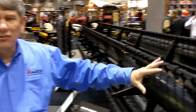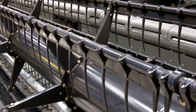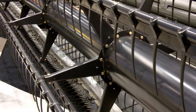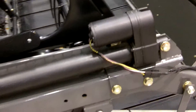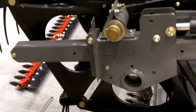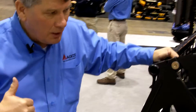You'll also notice that we don't utilize hydraulic pumps and motors on here. We actually operate all of the drapers as well as the cutter bar by way of mechanical driveshaft design. This is a twin sickle drive header, so we drive the sickle from both ends, which is a nice feature. We run the power through a driveshaft to a gearbox located at the backside of the header, then bring the driveshaft from the gearbox out to the epicyclic drive to drive the header. This is a unique feature found only on the DynaFlex — no belts and pulleys, no hydraulic pumps and motors. It's purely mechanical.